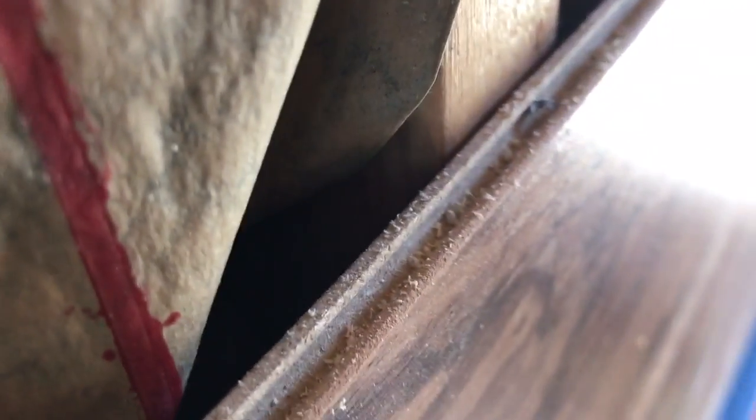Now, the way it goes is you can do one of two things. You can see here how I've nailed that in, and you can see the nail sticks out just a wee bit. You can take a nail set and knock that in, and once you do, your laminate will lock in place, because if you don't ahead of time, you'll have that issue. But now pretty much you just lock that in place, put your liquid nail behind, and then nail through up there like so. And I'll get the nailer here and do just that so that you see an example of this.